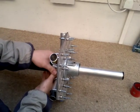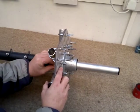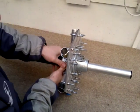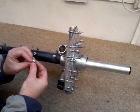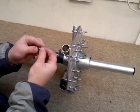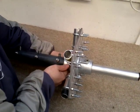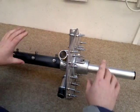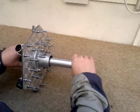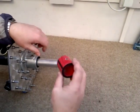Basically that will go all the way in. Right, here we go. Insert the washer and the nylock nut on the rear end and tighten. That's simple. Don't touch the grub screws yet — nice and simple. Make sure the grub screws are slack enough to insert the collar.